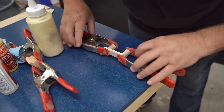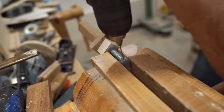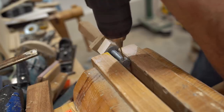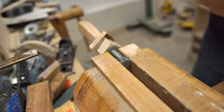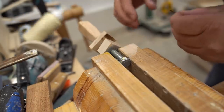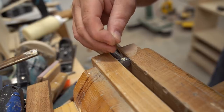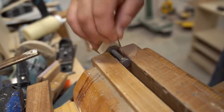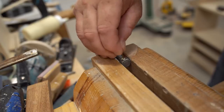I gave the glue about an hour to dry and the epoxy is set up enough to proceed. Before doing the remaining gluing operations, I want to add a pin to the nut at the end of the lead screw. While I'm fairly sure the epoxy will never fail, I'm absolutely certain that a pin in there will never fail, so it's worth the 10 minutes it takes to do it.